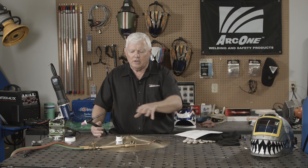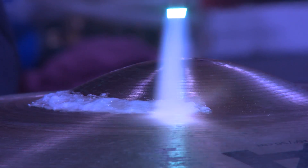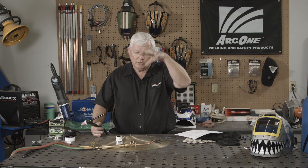This flux is a white flux — it looks like a white paste. I'm going to run a neutral flame over it and keep the flame moving because I don't want to heat this thing up too much. Apparently, that is absolutely killer for the sound on these. I'm going to watch the flux go from white and it's going to turn clear — it's going to look like a syrup. When it gets to that syrup look, I'm going to dab a little bit of silver filler and it should wet all the way through. I should be able to turn it over and see the silver.